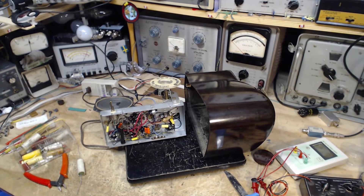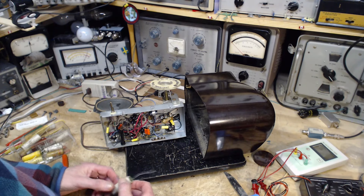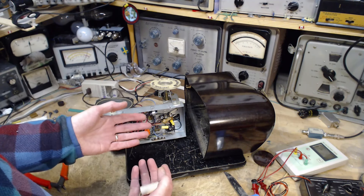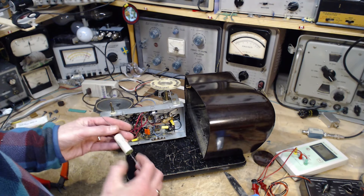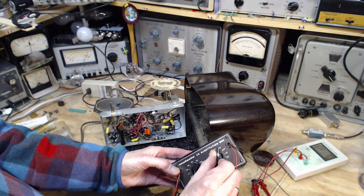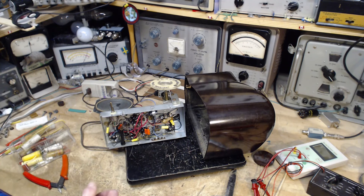Having torn that thing totally apart, I did not find any hint of a coil whatsoever. What am I to do now? Do I assume the wraps were wound in such a way that it produced an inductive reactance? I didn't see anything unusual going on in there. So maybe the best thing is to take the new capacitor — no coil — stick it in there and see if the radio works. Though based on my capacitor substitution box experiment, there's no way that works. I think before I spend time making a coil that may not even be necessary and doesn't appear to even exist, I'm going to experiment more.